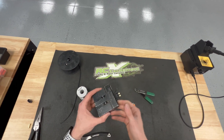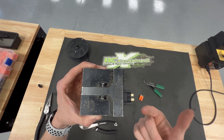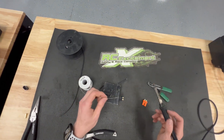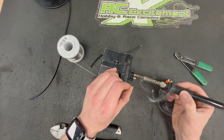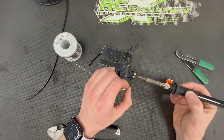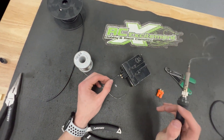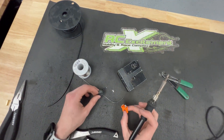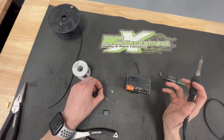The Traxxas connector fits nice and tight in there with these connector pieces. If you notice on there, it'll actually say 'wire side,' and there's a little line on it that you can't go beyond solder-wise — be really careful, otherwise it won't click in. If it does go beyond, you can always take a Dremel and remove some of that solder. I like to start on the very edge and add just a little bit of solder, because as you put the connector on wire-wise, the solder will flow forward toward the edge. I always do my Traxxas end second so the clip doesn't interfere with the wire length. We're also going to do a 5mm bullet so I can show you how to finish solder.